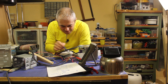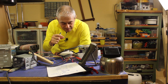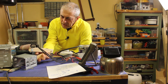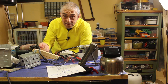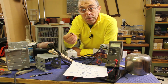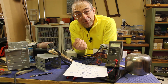This single cable without the terminal has a resistance of about 267 micro-ohms, and the terminal itself is about 290 micro-ohms. So even terminals, joints, and bolts — everything has its own importance in a circuit like this because the current is very high. This single bolt — the contact between the terminal and the coil of the transformer — has a resistance of 32 micro-ohms. When we use a workpiece, the resistance increases even more and the current goes down. The problem is that we don't have enough voltage, because with more voltage we can push more current through the workpiece.